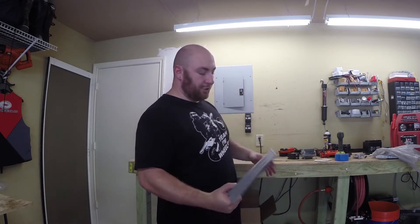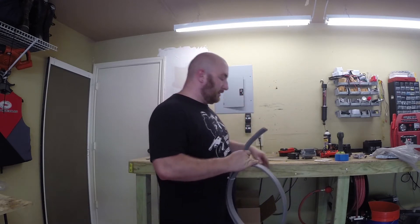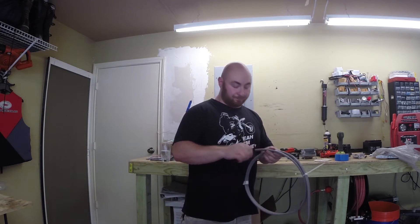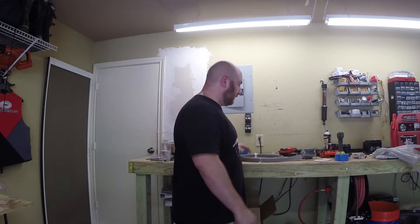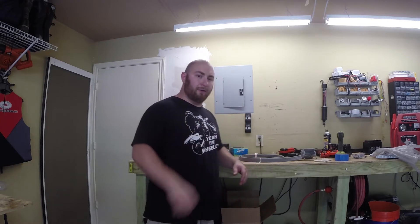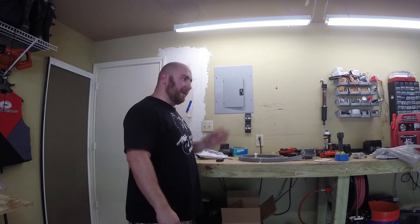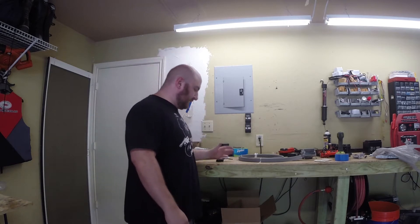When I take off the panel I'll show you guys what I'm talking about. We're going to hook all of this up on that side, but down here in the box we're just going to leave the wires taped up until I know exactly what I'm going to do with them. First step is we're going to pull off that box, and before we do any electrical work I'll kill the power to the house. For running the wires you don't need to kill the power, nothing's going to happen — but of course this is high voltage, high current, you can kill yourself.